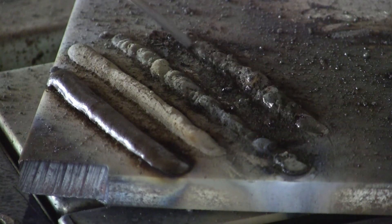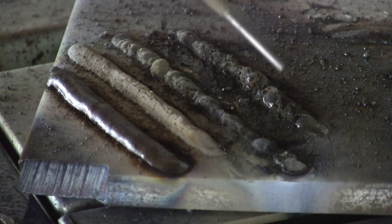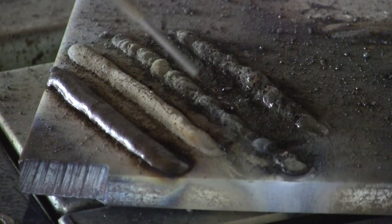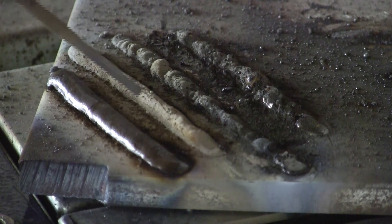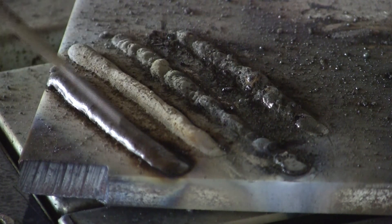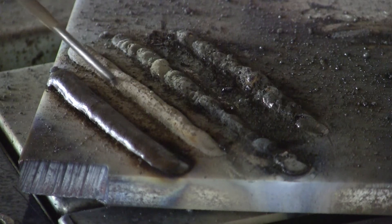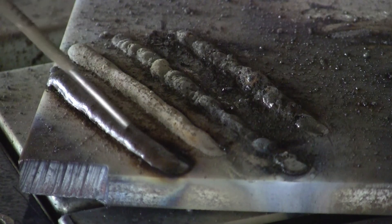This freezes the puddle where you're welding — it's a good penetrating rod. You wouldn't run this in cover passes; the weld would look ridiculous. All the spatter came from these two rods. These fast freeze rods protect the puddle briefly and then you move on. It does run cold and it does stick a lot. The 6013 and 7018 are fill rods, especially the 7018, and these rods protect the puddle in a different manner.